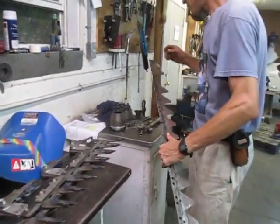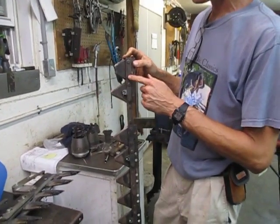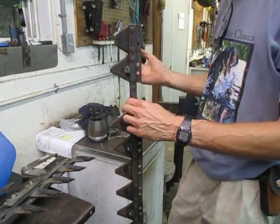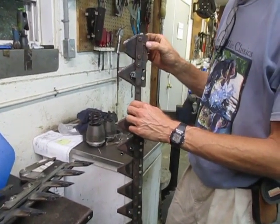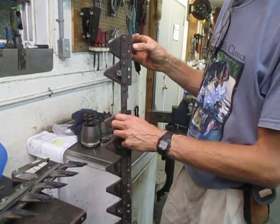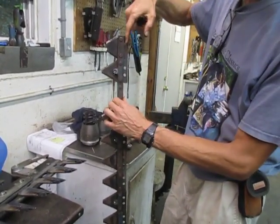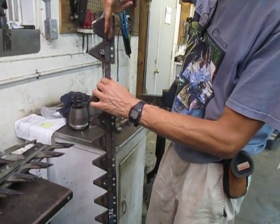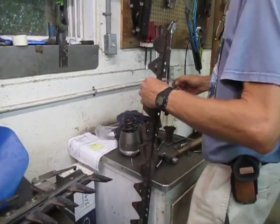On double action bars - and some single action bars, particularly the new laser bars BCS came out with - you can remove teeth an easier way using a 'guillotine' approach an old farmer showed me. You can use this method on any sickle bar where the tooth projects past the back of the strip. Put on eye protection because you're going to have parts flying around. Take a vise and open it just enough for the strip to drop down through it, so the strip rests on the solid body of the vise, not the movable jaw.